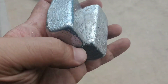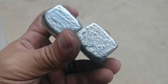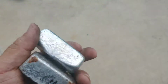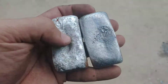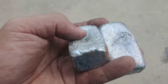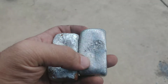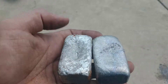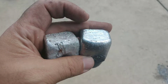This one seems better on the details a bit, but they both seem kind of poor still. I'm not sure if it has to do with degassing — something I could probably start looking into. I don't see any big giant cavities in either one, but noticeably the cooling is a lot more exaggerated here where it starts to solidify and shrink. The last part that remains liquid gets sucked out to fill in the solidifying gaps. You don't see it as much with the silicon alloy — it's not as exaggerated as pure aluminum. So for shrinking purposes, the silicon does help. It does make it shinier too.